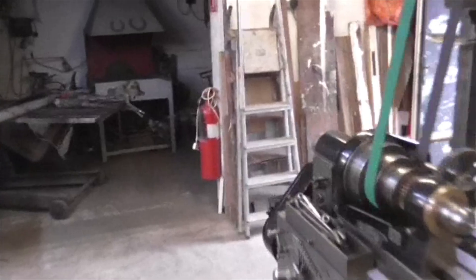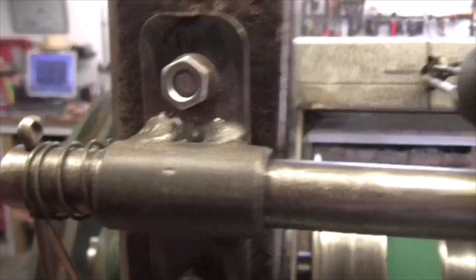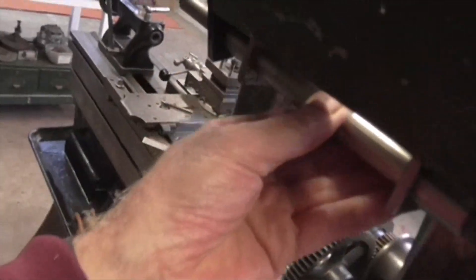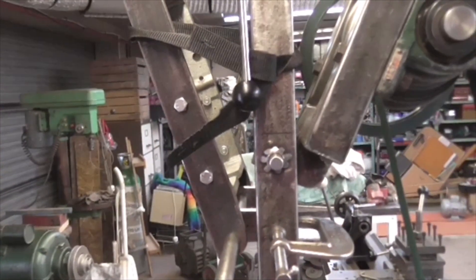Right, let's get back to the job in hand - the motor plate. What I'm going to do is lower this very slightly so that that plate fits just below there, and then I'm going to square one up, tack weld it on, and then get the other squared up so that the slide works and everything is square. It is actually terrifically square anyway, but I do like to get it right when I can.